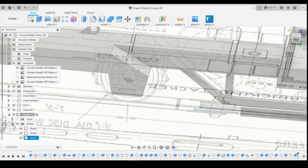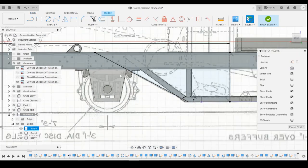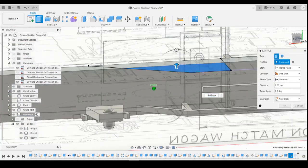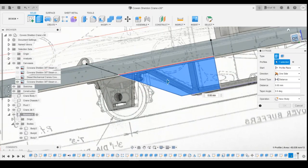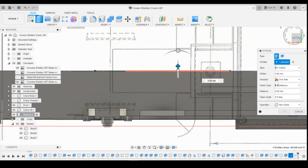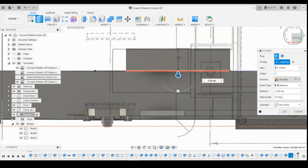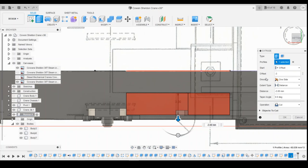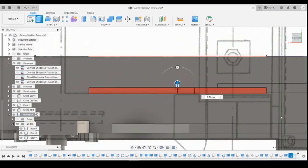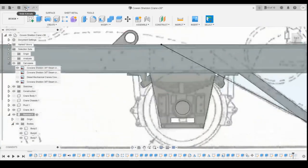Okay, so the next thing we need to do is draw side and floor in. So we can come back onto this back surface, have a look on this sketch here. We've got that profile that's already drawn there, so we can extrude that. Set start, -3 millimeters. That's not achieving what I wanted. Let's go back. Right.